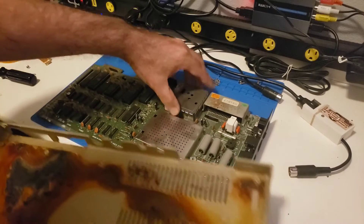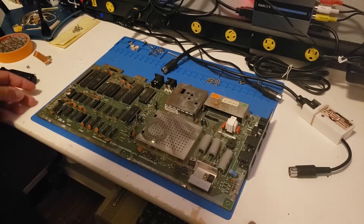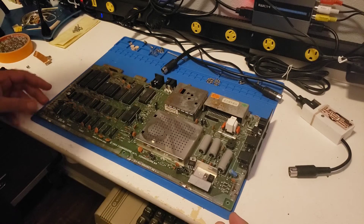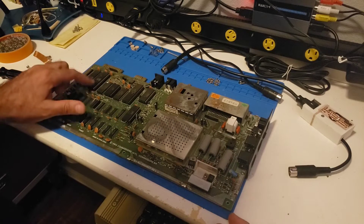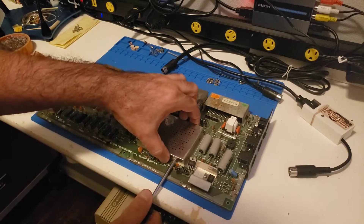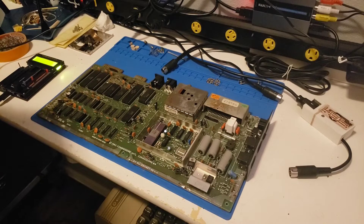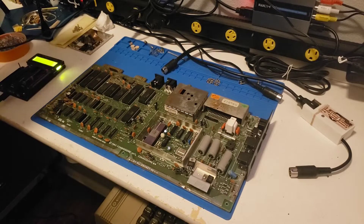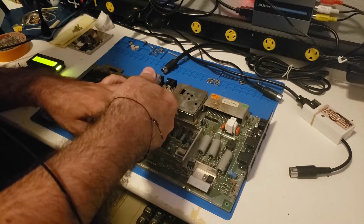So this will be an interesting cleanup. Well, it is what it is. I'm going to start checking some of these chips, at least the ones that have been socketed. Obviously the board is getting voltage and everything — it's booting up, getting a black screen. So let's start with the VIC, then the SID, then the PLA.